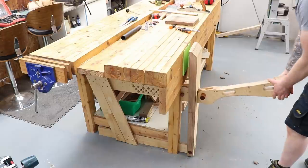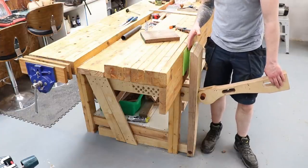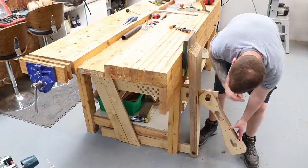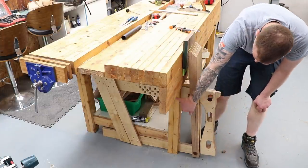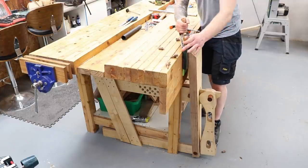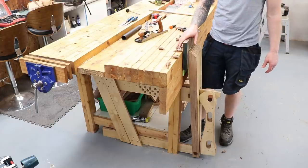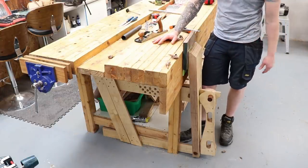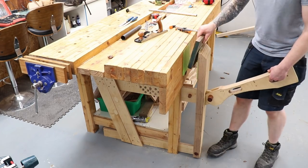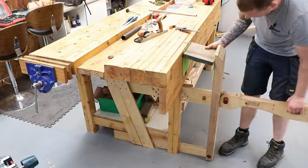Let me give you a demonstration. Pull it back, slide in, drop in our piece. I've put two sponges in here just for gripping force — I can't get leather or cork so sponges it is. There's a bit of slip so I pull out slightly until that locks in place. Now we have clamping force — it's not as powerful as the sawtooth but we have the bar if we need it. The piece is in the vise, and I can plane and work away. It's not moving, it's not budging, and it's wedged to our table — that's the beauty of a leg vise.